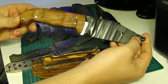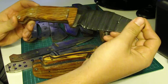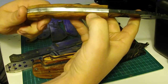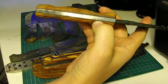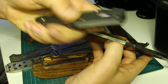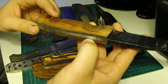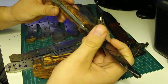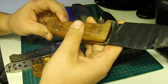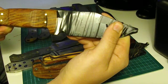This is a model I do called the Camp Knife — a heavy duty Camp Knife in 200 thou 1095 spring steel, with stainless pins and a stainless lanyard tube. I use G10 for the liners, and most of you know G10 as a handle material — for example this Spyderco Manix uses G10 for the handle scales. You can buy it in thin sheets and I use it for the liners on my handles, which is a preferred product for fixed blade handle liners. Everything is epoxied down, and this blade is taped up because it's been hand-finished, hand-sanded, and I've put my maker's mark on it.